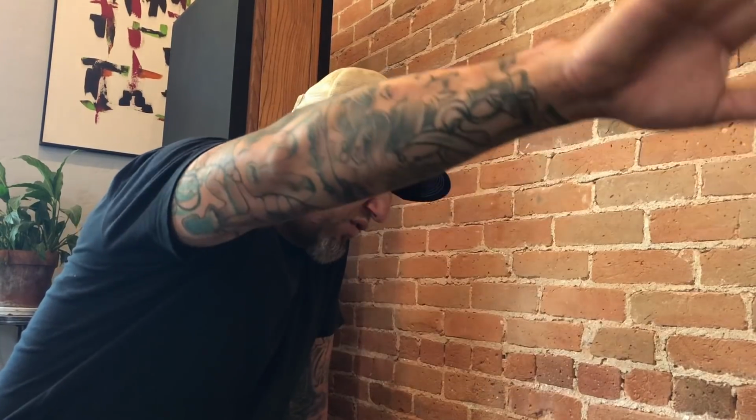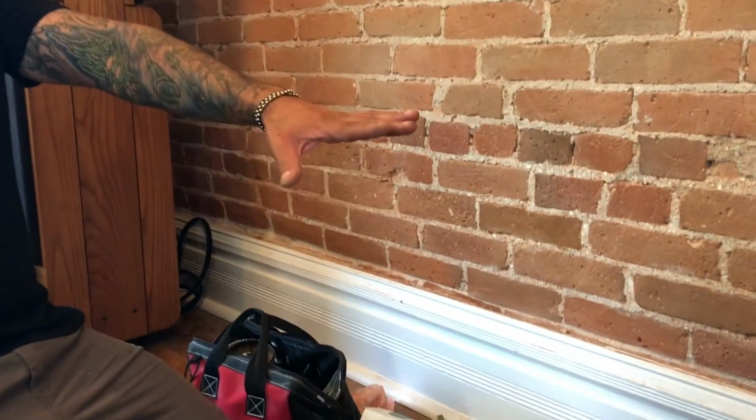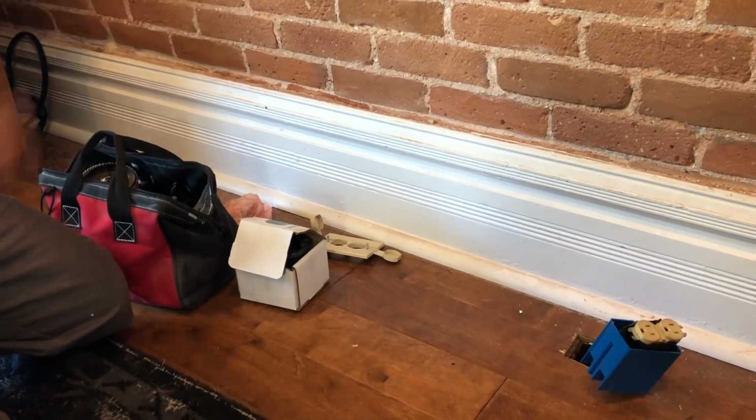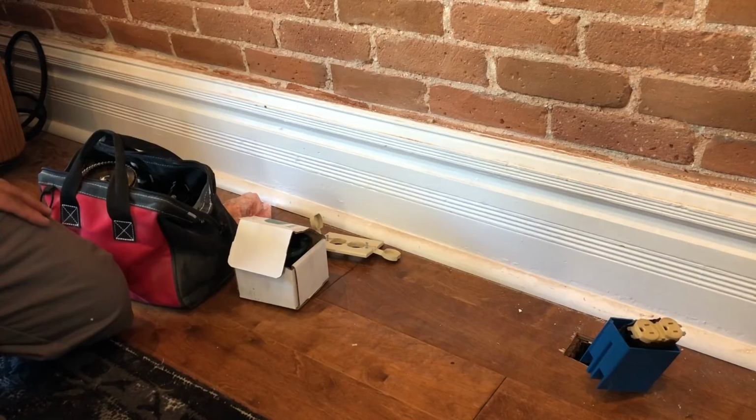So here's something that we could do. We could loop all those wires together and tie them through to where that device is no longer there. We can run the wire here and use that same box. It's not really full, it could take another wire. And we can just put your PS Audio outlet, the PowerPort Classic, into that box if that's how you decide.